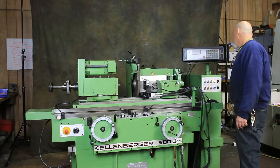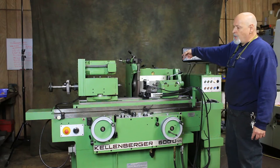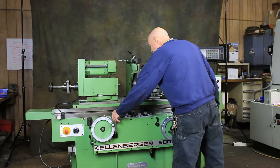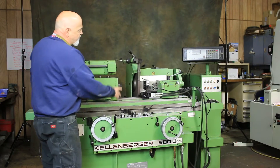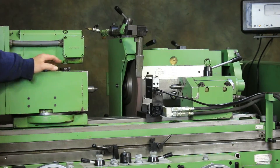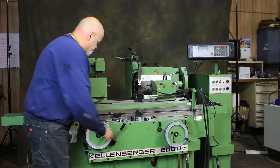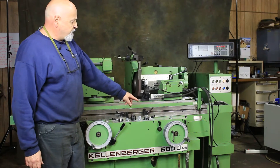I'm going to start up the grinding wheel. At the same time this wheel starts, we're also starting an ID spindle in the rear. You can disconnect that if you're not doing a lot of ID grinding. We can bring in the cycle here. You can see when I go in and out, the gauge head goes in and out with the slide. Then you see our infeed hand wheel and the table starts moving.